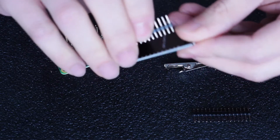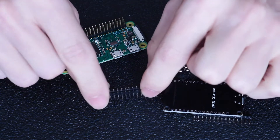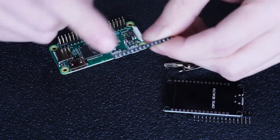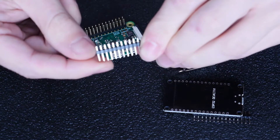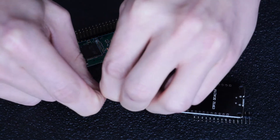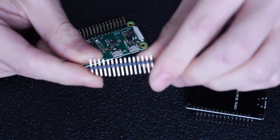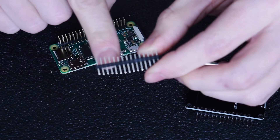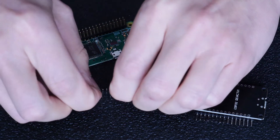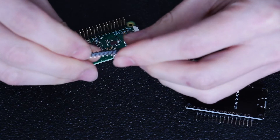One of the reasons I don't like to press it down into a breadboard is that sometimes the resistance of that breadboard will start to actually shift the plastic holder, pushing your pins up. That's what I saw in some of the posts — people's pins were coming out a little crazy, getting an effect like that because they pressed it into the breadboard. Doing it with an alligator clip is not only pretty quick, but it prevents that from happening.